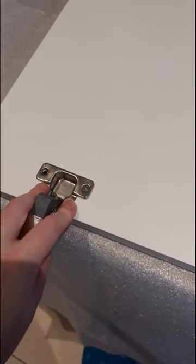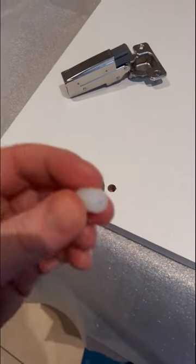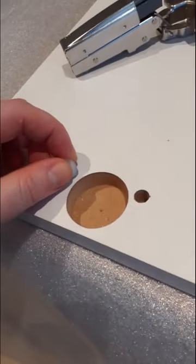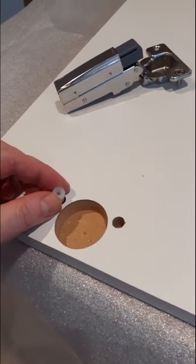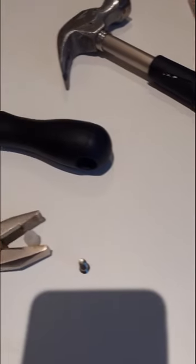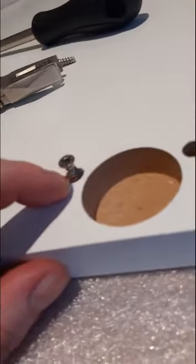To attach the hinge you need your hinge dowels. These dowels that I got with the new kitchen doors are quite different from the ones on the original. It's tapered at the bottom end to guide it nicely. However, it will not go in very easily even with hammering, as I have tried. So the alternative I've done is to take one of the screws from the hinge and hold the dowel in a pair of pliers and screw it in with a screwdriver - the screw just about two or three mil. Then I hammered that into the hole.